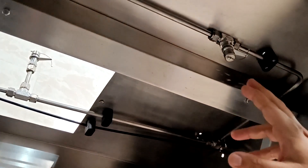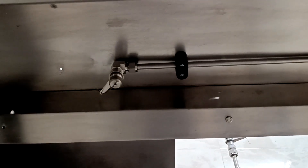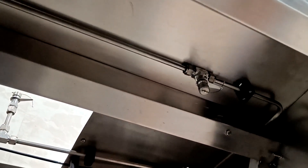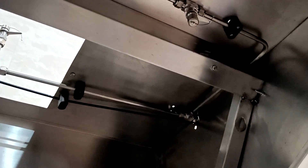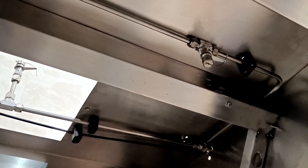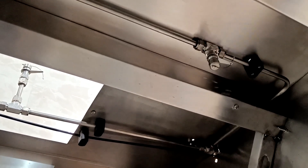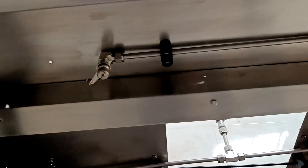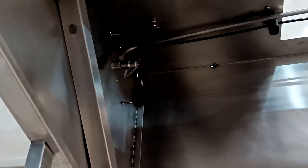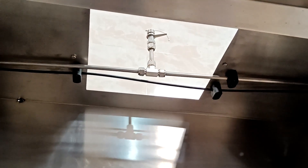All the supply lines have connectors and fittings attached to them. A fitting can be connected to a supply line to which a nozzle can be attached. There are only two types of nozzles used in this system: the 15 degree nozzle and the 40 degree nozzle. In most cases, the nozzles used are 40 degree nozzles. But in exceptional cases where the plenum length is from 0 to 1200 mm, you require only one 40 degree nozzle. If it goes from 1200 mm to 4 meters, then we will use one 15 degree nozzle, which has a reach of about 4 meters.